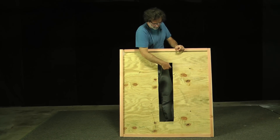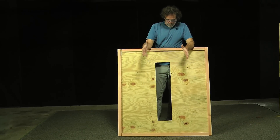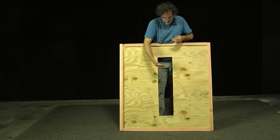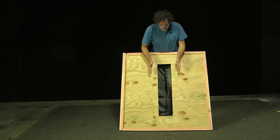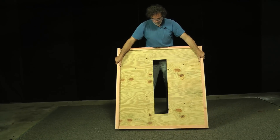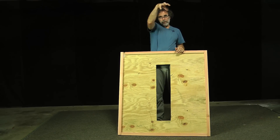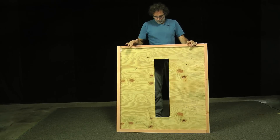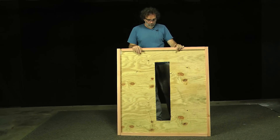The reason I've cut this long hole is we're going to put our light up top in a little box. The box with the light in it can be moved — if you want the light toward the back of your still life you can set it back, or you can move it forward. If you want to move it to the right, you can slide the whole roof to the right or left. By doing those two things you can position your light anywhere over your whole shadow box table. Let's put this on top of the shadow box and I'll explain a couple more things.